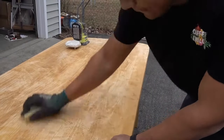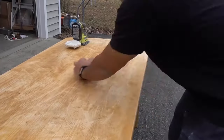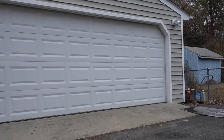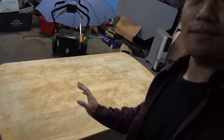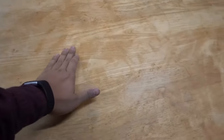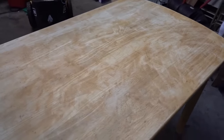Sanding by hand was a little bit more manageable because I was able to wipe a little bit off the sanding block and just keep repeating that. Once it was a little bit drier and smoother to the touch, I was ready to go in with the actual power tool. But I needed to go somewhere so I was calling it a night. This is day three of working on this table, and I think I'm finally going to finish sanding today. I don't even know if I'll be able to stain it today, but it's getting closer to being done. You can see it still has some uneven spots — sanding will definitely help a lot.